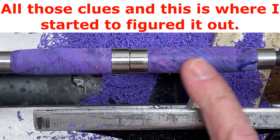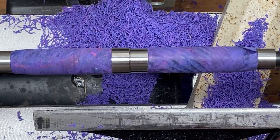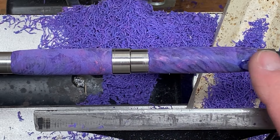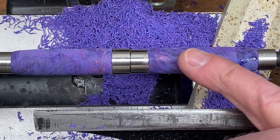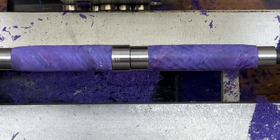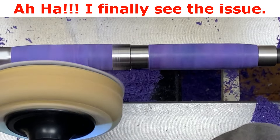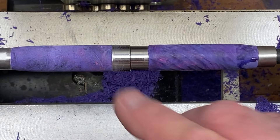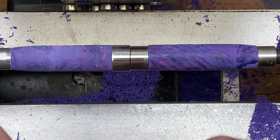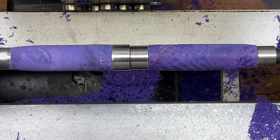I was getting a lot of chatter down here — take a look at the waves I put in this blank. That probably contributed to what I did here. I don't know if maybe my mandrel's a little bent. Looking back, hindsight being 20-20, I should have gone ahead and turned between centers, but since it's looking rough like this, I left it a little proud of the bushings on both ends, and we'll take care of that during sanding. I prefer to do it with my tool and get a nice smooth finish, but in a situation like this we got to drop back and punt. I've got the speed turned down to around 840-850 RPMs, and we are ready to begin sanding. The mandrel is wobbling — I think I've bent my mandrel. I'm going to get these blanks off the mandrel and onto turn between centers, because I think we'll have much better luck completing the pin. I just don't want to deal with that wobble.